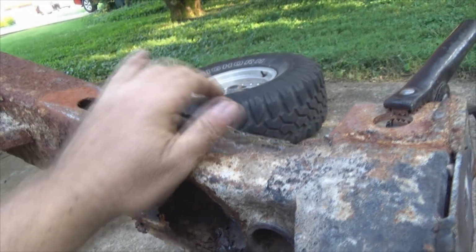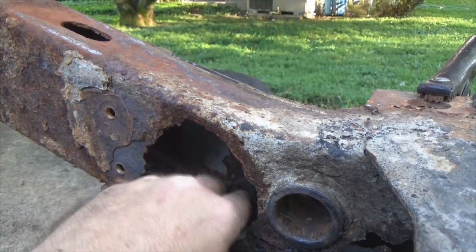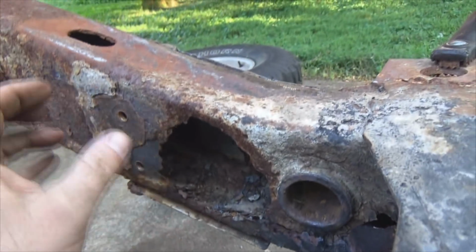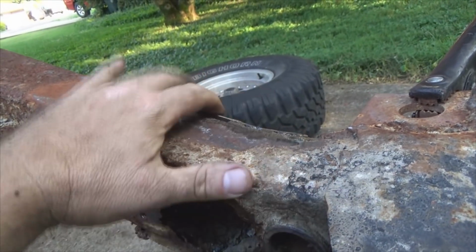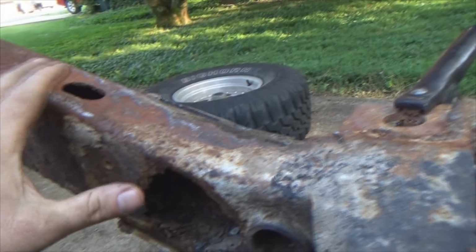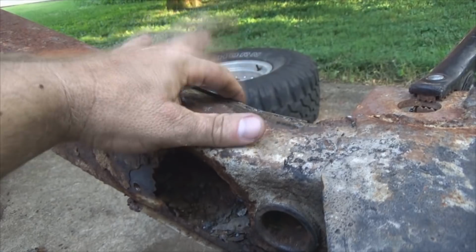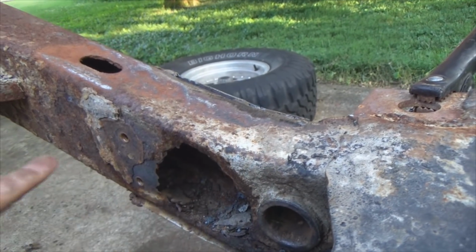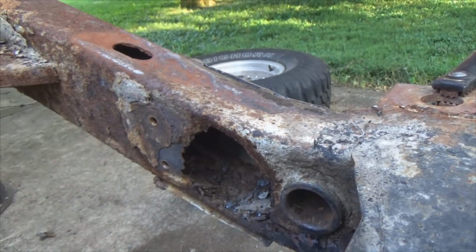The reason I cut that completely out is because it's a hole all the way through the frame right here. And plus that laps all the way down at the bottom. So what I want to do before I get too froggy taking that out, even though it's a crap weld, it's providing some reinforcement. So if I can get this side plate in and that top plate in before I put this plate in, before I cut this right here out to put the side one in, they'll give some strength and rigidity to prevent anything from shifting, moving, or anything like that. Cool.